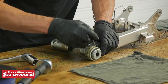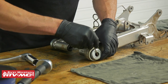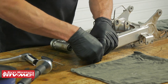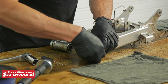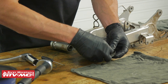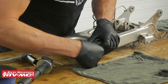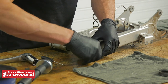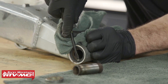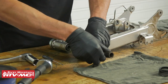To get these bearings out we need to remove the collars on the ends. These ones sit over the seals. Some will be pressed into the seal. As you pull that out, sometimes there are washers or bearings underneath. This one just has a washer and a rubber seal that pulls out. Sometimes you'll need a seal puller or a screwdriver to pop those out, and then after that we remove the collar.